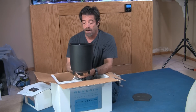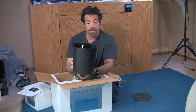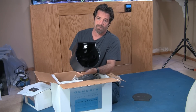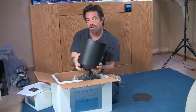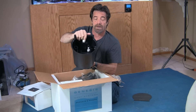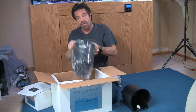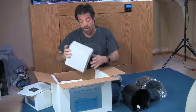When installing the metering bins, it's critical to get them perfectly leveled — if they're tilted to one side, they may not change out the exact amount, but there are levels included as a solution. Inside each metering bin there are two standpipes: one where new water comes in and overflows into the bin, and another where water can overflow back to the source to ensure a perfect one-gallon fill. There are two metering bins in the box — metering bin one and metering bin two.